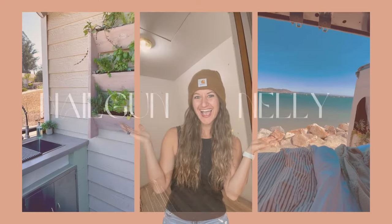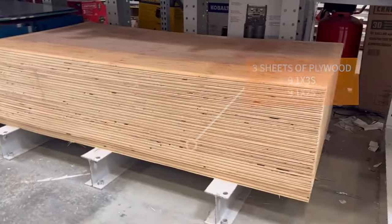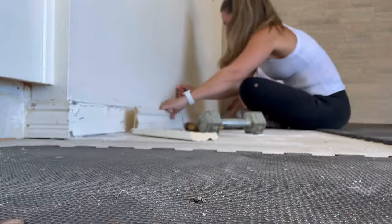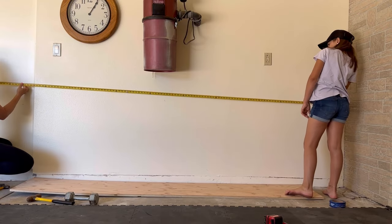For this project it required three sheets of plywood that I had ripped down to 17 and a half inches wide so that the cabinet would be 19 inches in total depth once finished. You will also need 1x3s and 1x2s along with wood glue and brad nails.